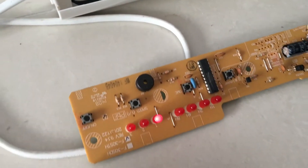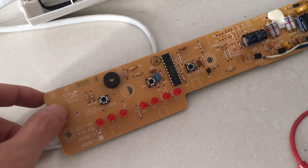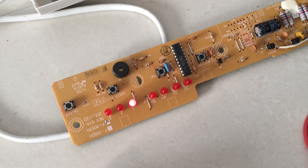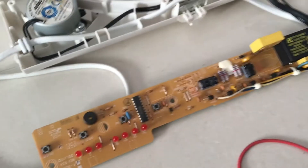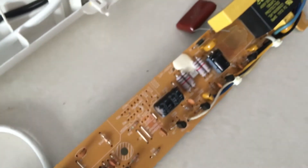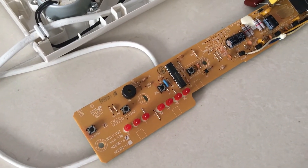To make sure that the capacitor is the only cause of the problem, I will be trying to piggyback another capacitor to see if it resolves the problem. As of now, the microcontroller is rather unstable and it does switch off when I try to turn on other functions. Now that I have piggybacked the new capacitor along with the old one, I am able to turn on the timer mode, indicated by the extra LED lit up on the right side. Looks like this is the only problem.